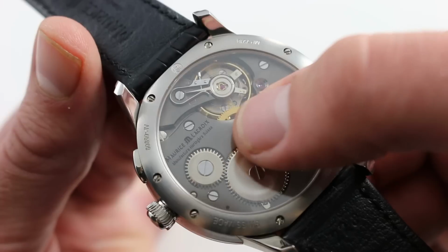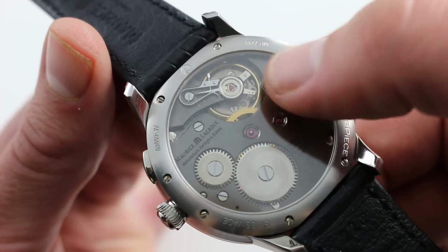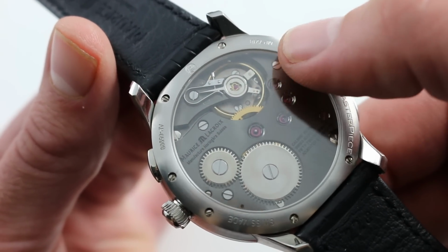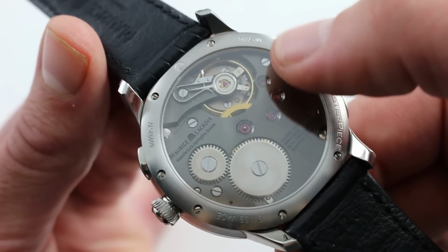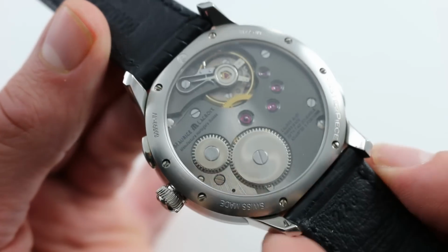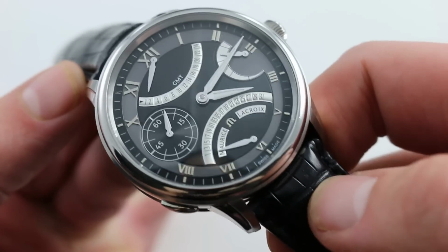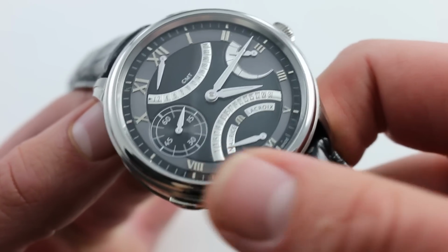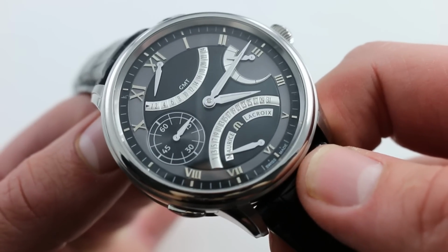There's also a tight and even perlage across the base plate beneath the balance, which is that classic oversized pocket watch style balance, chugging away, like I said, at 2.5 hertz. It's evocative, and it's got an old vintage style cadence to it when you hold it up against the ear, but make no mistake, the dial itself, the case treatment, and the combination of features on this watch are a remarkable avant-garde for a watchmaker that offers a compelling value proposition in high horology.